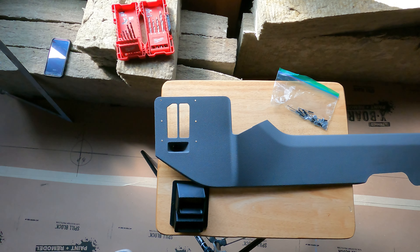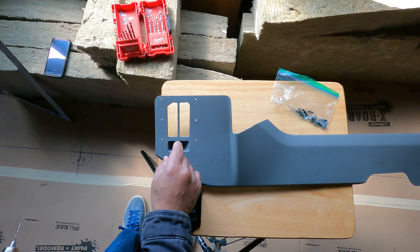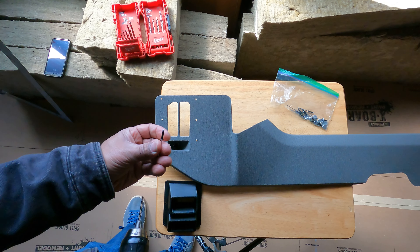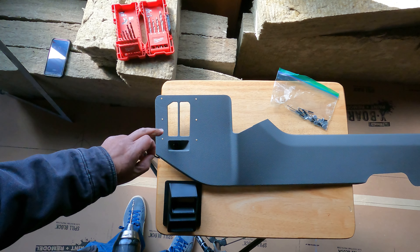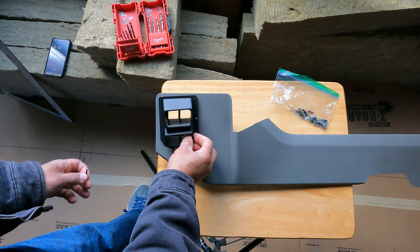I'm back inside now — it was too cold and windy outside, so I came in for better audio. I just received my rivet gun. I want to do a quick correction: when I drilled the holes earlier, I incorrectly used a 7/64 bit — that's wrong. You have to use a 1/8 bit, so I came back and re-drilled the holes. The reason is these rivets need to slip in with no problem, and the 7/64 was just a little too tight. Make sure you use 1/8 holes to match the rivets to your vent.